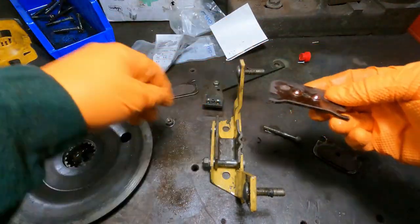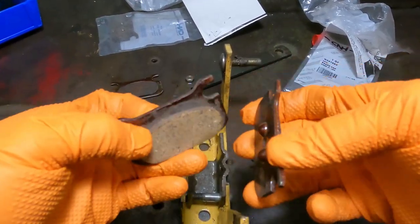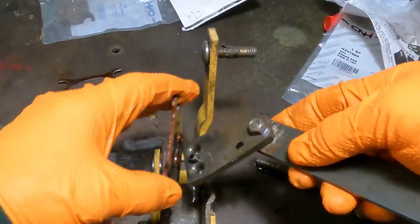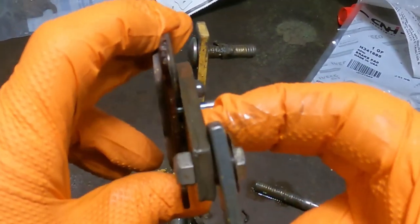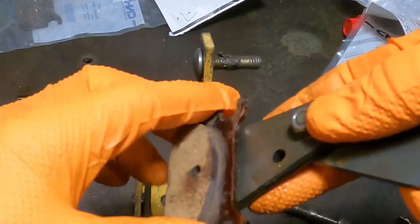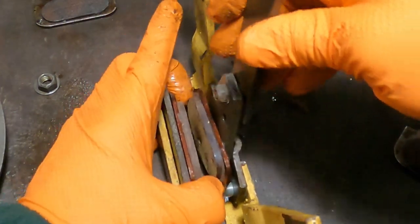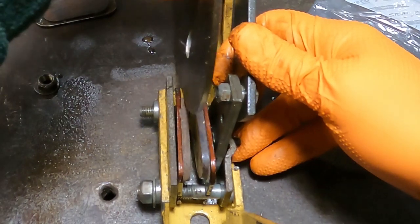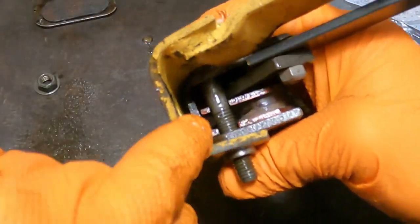We got the brake pads today. The difference between the pads is one has the set of molded in kind of spheres or half balls, and this one has none. So we know that the half balls go on this side because when the system works, it wedges that pad out using the set of balls. Then there's a detent for this pin. So we go like that. So now we have our pad. If you look, that's a pretty big gap for this rotor. That really backs off. That's asking a lot. So we're just making sure that they're captive in there, and they are.